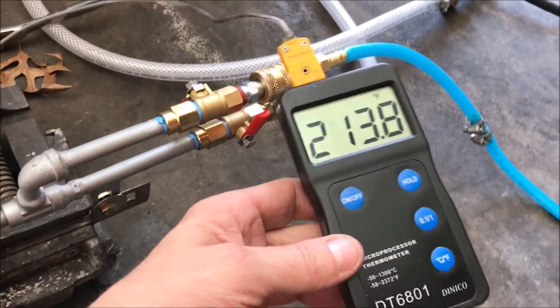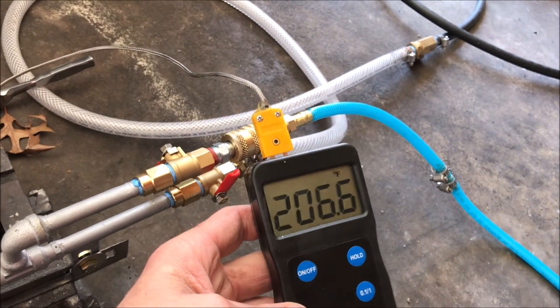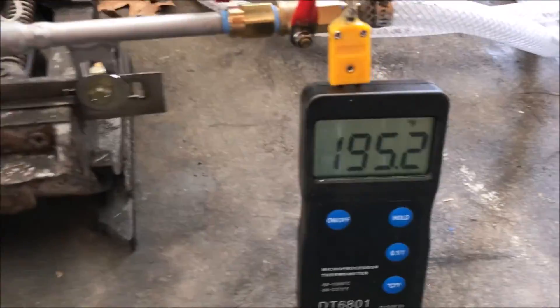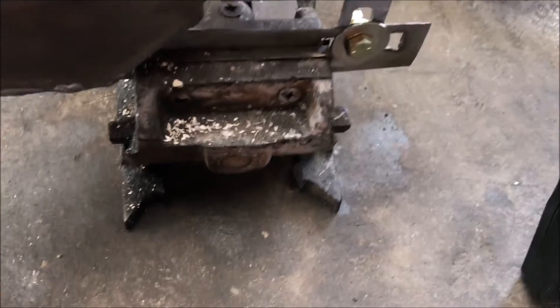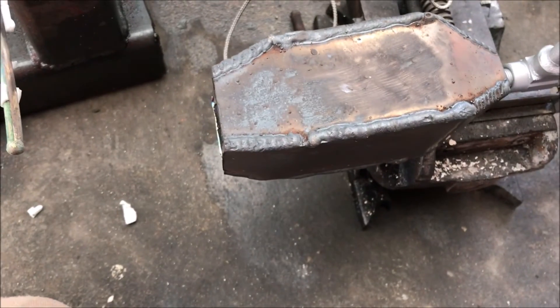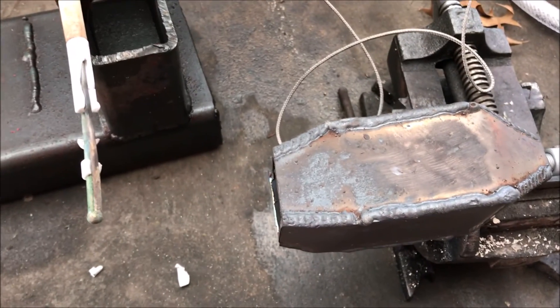Now the max temperature of this thermocouple is right around that — I believe it's 2370 or something like that. It's supposed to have an alarm on it; it did not trip the alarm. So as far as a review for this thing goes, I'll leave a link in the description for this thermocouple. I totally heat-shocked all the ceramic off of it, but I also got a condensation leak here — my braze didn't seal, I didn't grind that metal good enough. Looking pretty good overall. Very pleased with how well this turned out. I almost didn't think it was going to hit it.